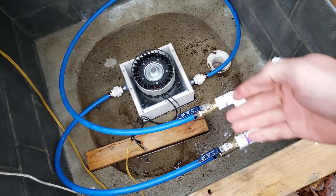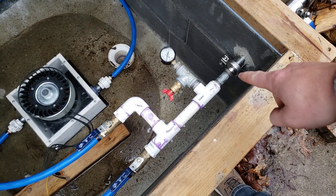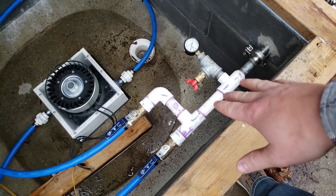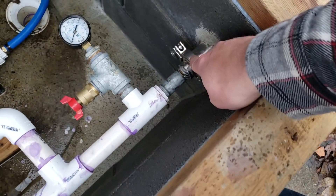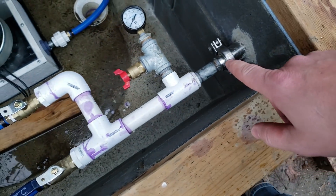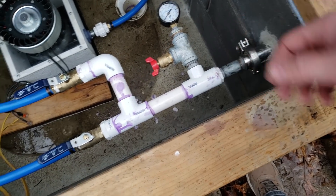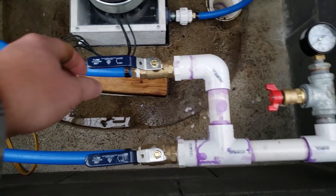I have modified this a little bit. I still have a bottleneck there of three-quarter inch because that's the only way I can get from this sanitary fitting right now to other stuff that I can source locally. I have more sanitary equipment coming — this type of connection here, here, and here — that will allow me to branch off with larger inch-and-a-half, or in this case 38 millimeter, fittings.